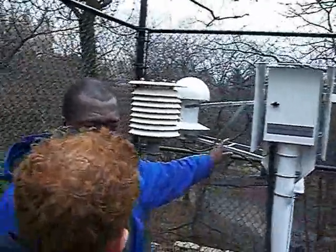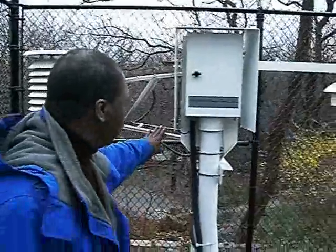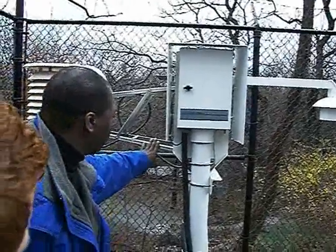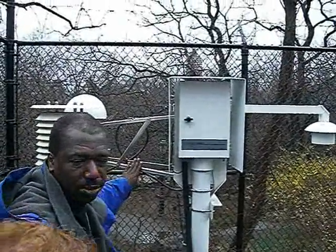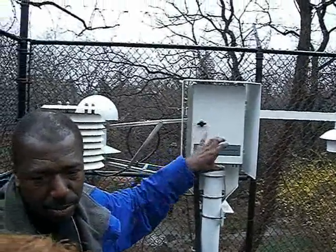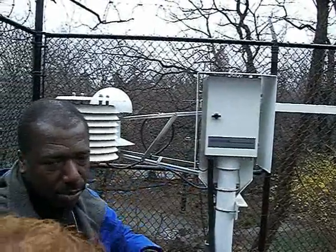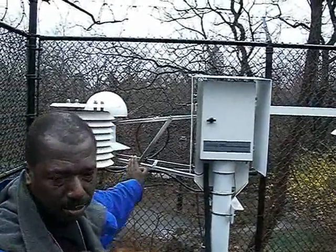The newer version is called the DCS-1; the older version is H83. Basically what it does is give you your temperature and dew point. What we've done in recent years is modified the system — we now only use the actual ambient temperature because the new system uses primarily a dew point sensor. This is called a DCS-1 and it's designed only for dew point, though right now we're just using it as a backup.